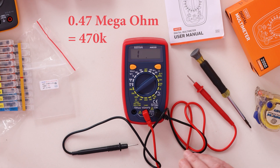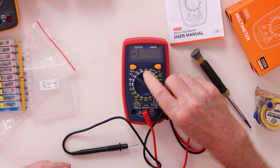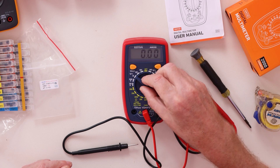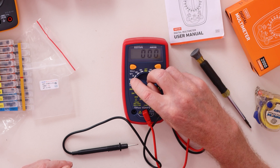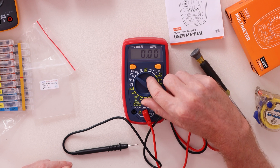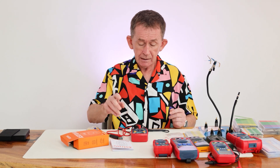The next section is really for batteries — those are DC volts. You can check batteries up to 600V or 200V. For a 9-volt battery you're going to be on the 20V setting. The lower settings are millivolts — 2000 millivolts and 200 millivolts. The 20V setting is what you need for your 9-volt batteries and similar.